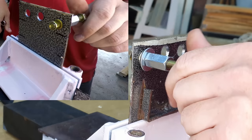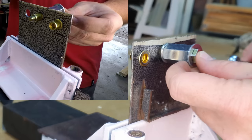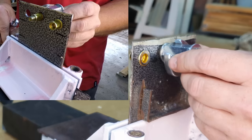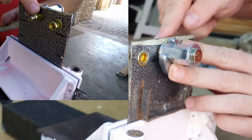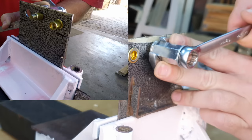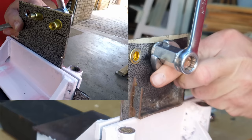To remove the tool, loosen the nut slightly and unscrew the bolt. Now set up Method 2: insert the bolt into the hole, hold the nut in place — it must not move — and press it against the surface with the first washer to stop the rivnut at the back from turning along with the bolt. Hold the nut and start turning the bolt.